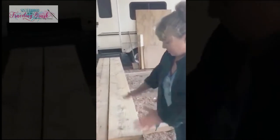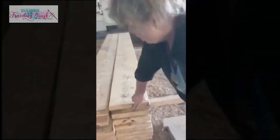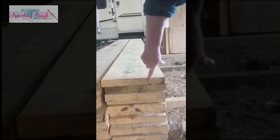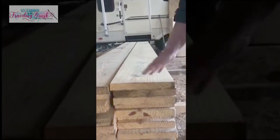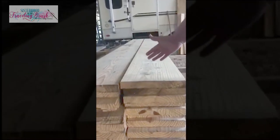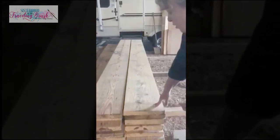I'm at my husband's workshop — you'll probably be at a lumber yard when you're doing this. We have a big stack of boards here, and these are 2x12s. They're not exactly two inches thick; they're one and a half by about eleven and a quarter wide. Whenever I'm talking about board foot, we're talking about how to get to 144 inches — a 12 by 12 one inch thick — but we're using a 2x12 because I'm going to want to stand these up on their side for the projects we're going to work on.